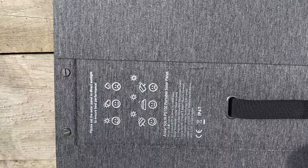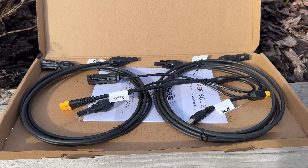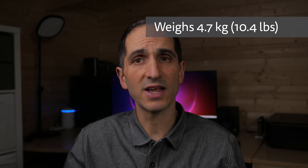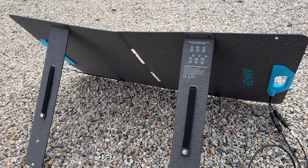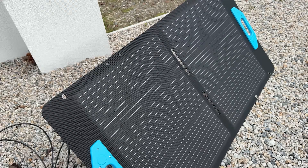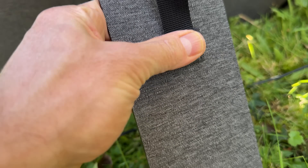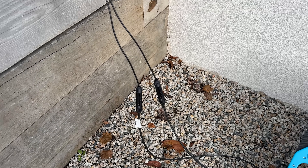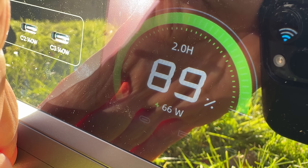I tested solar charging with Anker's PS100 100W portable solar panel. This comes with an MC4 adapter cable to connect straight into the power station's XT60 input. It's a modest output for a solar panel but that does make it fairly lightweight at 4.7kg, and together with its compact size and large carry handle it's extremely portable and quick to set up. Magnets keep it folded and it takes less than a minute to open it up and adjust the integrated feet for the best view of the sun. It also has an IP67 waterproof rating. Typically the sun barely made an appearance when I first tested the panel so I only got around 20W, but I tried again another day and got 70W.